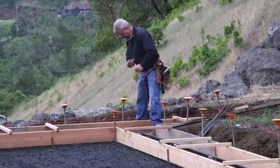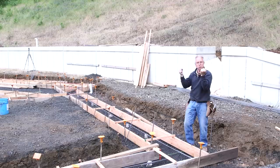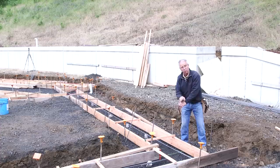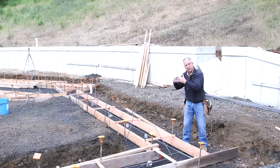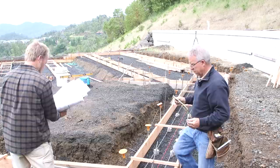This foundation is resisting loads pushing down. There will be some hold-downs providing resistance to uplift, but primarily this foundation is holding the world up. These footings get their strength resisting downward loads from the longitudinal bars, and that strength continues inside the stem wall — bond beams tied to the footing with verts. The longitudinal bars at the bottom all act together to resist any tendency for this foundation to break or crack under load, regardless of what the soil may do in any particular spot.